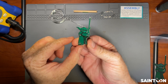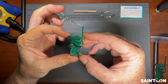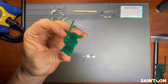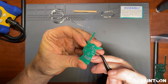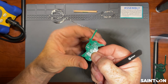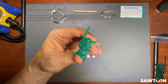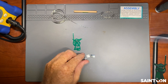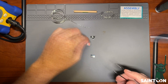Other things in the bag: the PCB of Mr. Yoda himself — it's a green PCB. The front side shows Yoda; the back side has a Star Wars logo and positions for LEDs. There's an LED position at the top, another on his shoulder, and one down by his feet — these provide backlighting for the mini badge. In the center, grouped together, are two resistor pads, and we're going to attach the resistors first.